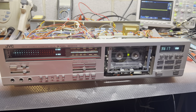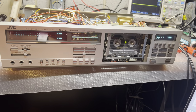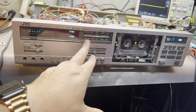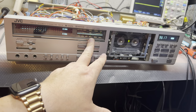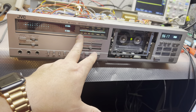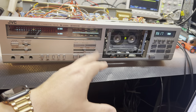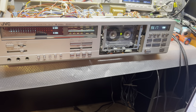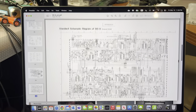So, I did an investigation. I checked how this deck measures frequencies - it flattened out between 50Hz and 12.5kHz pretty well, but everything above 15kHz it just won't record. I checked the schematic and I'm going to show you how it works.